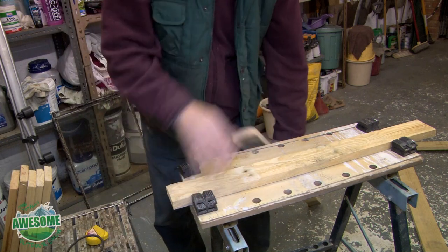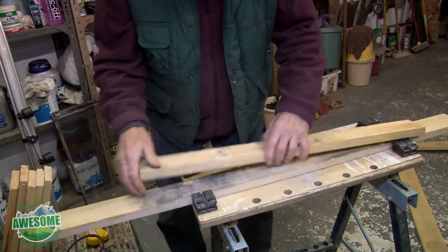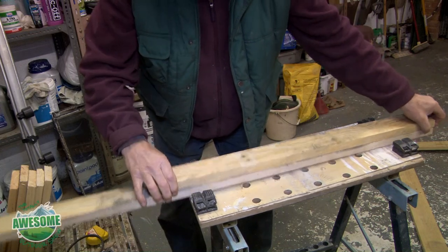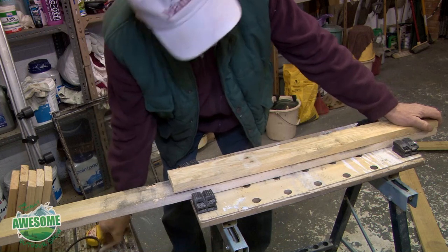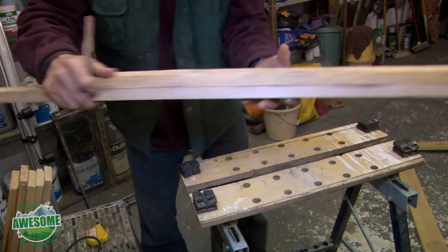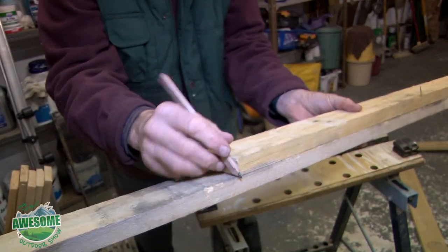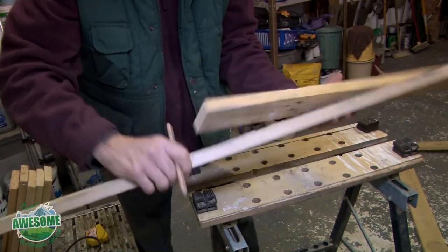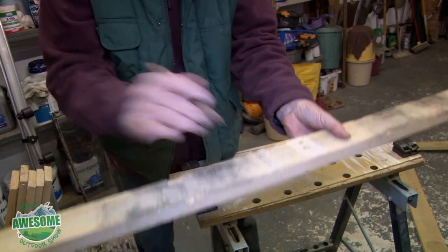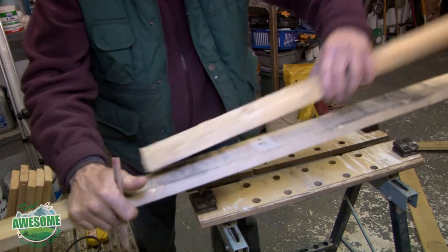Now I'm going to be using this one to lay over the top of the other one, so that if you are making, let's say, a load of fence panels, just be aware that although you put your hand on here to level it up, you're going to have to keep measuring. Cut that one, okay? So imagine that's off. This is a bit you keep in. You cut that off. Then you do the same again, the same again, the same again.